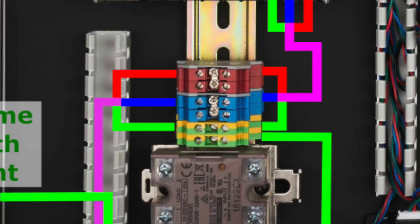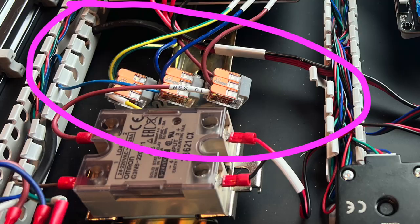One of the suggestions that I have for improvement would just be to change that to white silk screening. And I'm not a big fan of the UK 2.5N connectors that are used for the AC to share with the components, basically with the power supply and coming off the inlet. I just found them kind of fiddly — you have to assemble them, they're just another thing that you have to put together. Some people use them and love them. I ended up using Wagos, and I think it's simpler and it's a little bit cleaner.